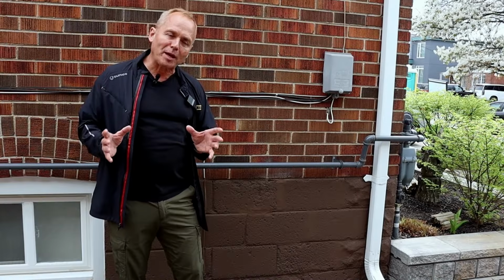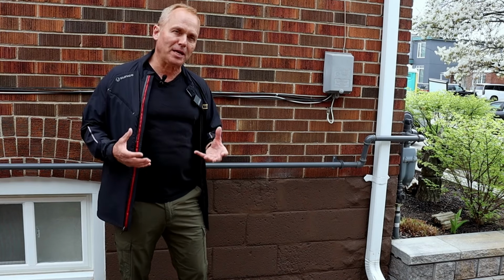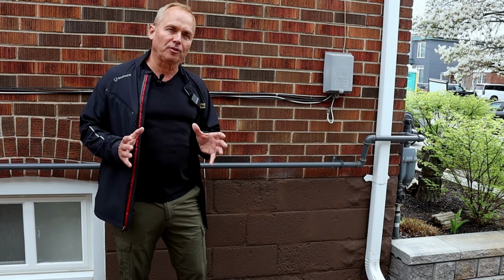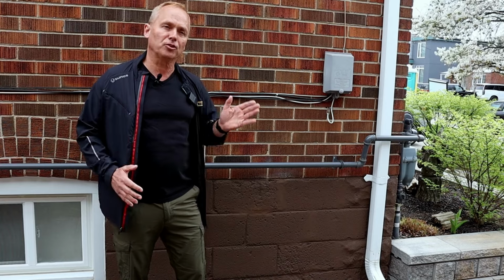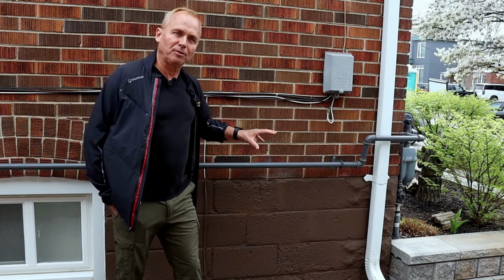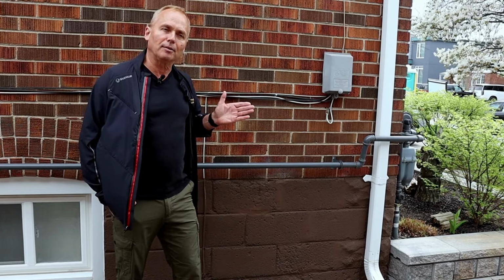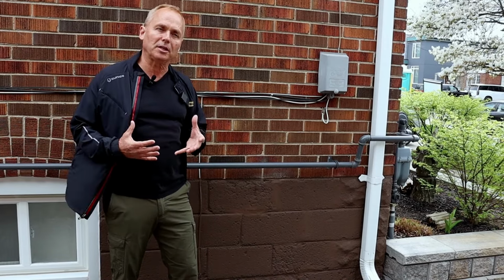I just wanted to take a quick moment and show you the advantage of having your home, your foundation, your masonry work sealed with SurGuard, the high build foundation vertical coating. This has been done. We've already prepped it. We've cleaned it. We've prepped it for the SurGuard. We've applied a couple of coats. It's protected. It acts like a plastic. It's a water-based acrylic, as I mentioned.